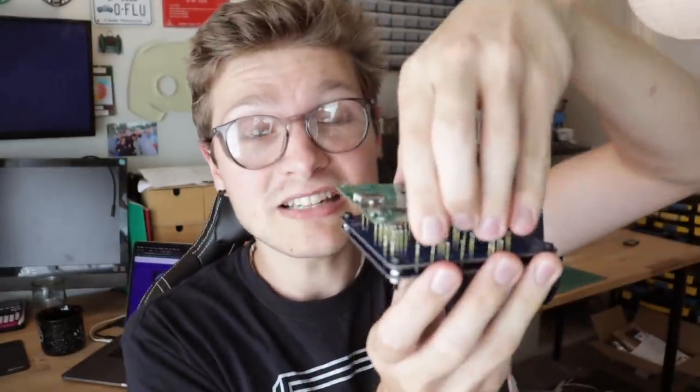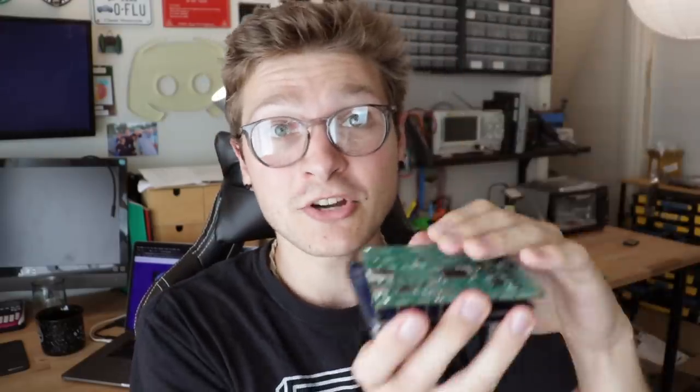All right, so this is dope and everything, but there's still two-thirds of this whole thing missing. The first is the mechanical assembly of this, which is actually going to take the motherboard and put it really precisely on top of this so it's really easy to have all the pogo pins line up with the holes they're supposed to connect to, and press it down and hold good constant pressure onto the motherboard into the pins so that the whole test procedure can happen. That's something that Lucian is working on right now.